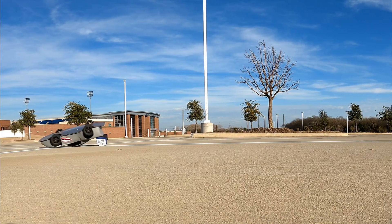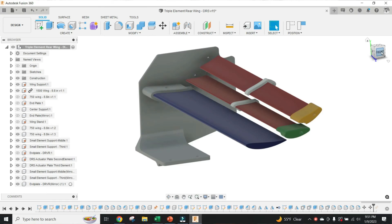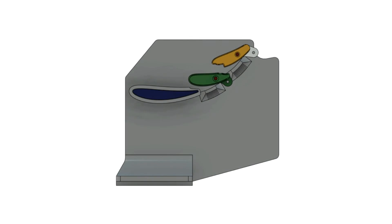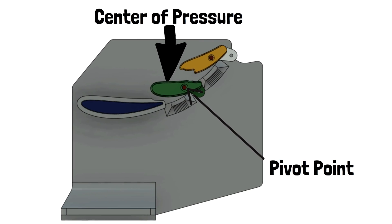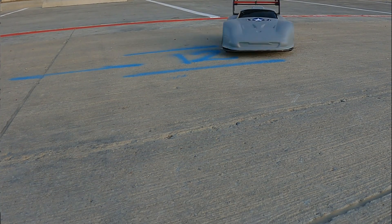This mechanism overall is set up to fail in the high downforce condition, so I get maximum control if something breaks — or at least theoretically it is. That's because the center of pressure of each of the elements is ahead of the center of pivot, so it should kind of push it back down into the high downforce condition. Let's go give it a few shakedown laps to see if things work as I hoped.